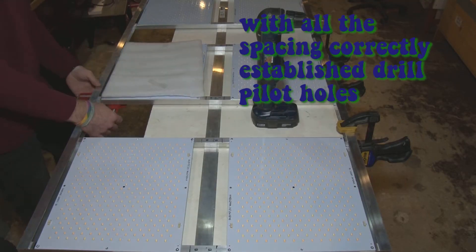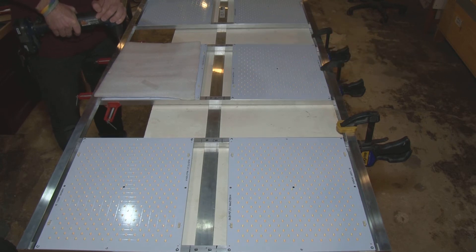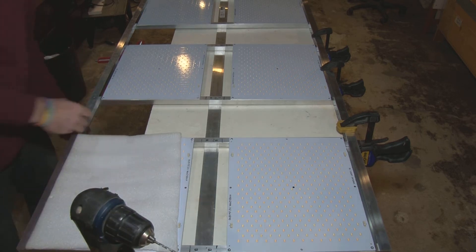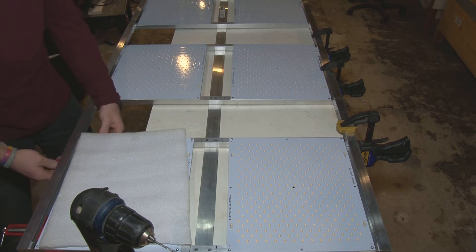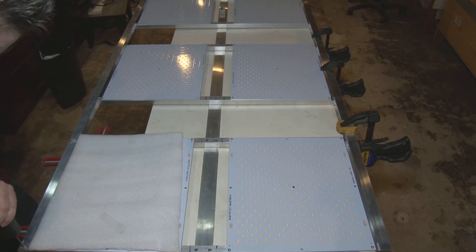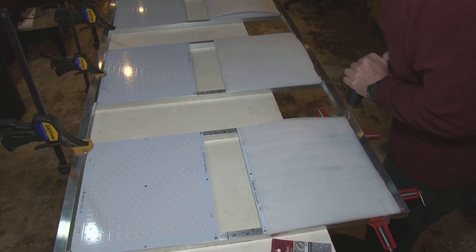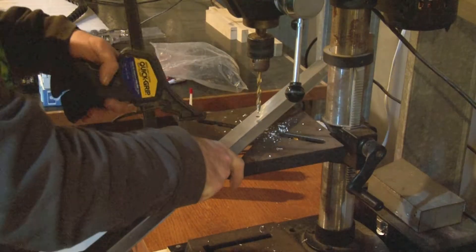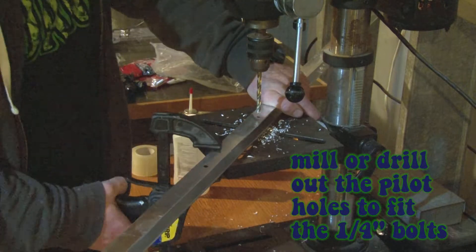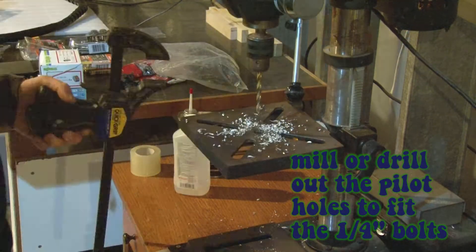Now we drill out pilot holes with all measurements at the right spacing on the C-channels, so I know where to drill for those quarter-inch screws. I also laid down the silver bar I already made holes in — the square aluminum — and drilled into those to have pilot holes for mounting the flat aluminum bar to the middle of it. That gives extra support plus a nice way to mount all my drivers and project boxes for a clean wire line. I take those C-channels to the drill press and using the pilot holes, make sure the quarter-inch screw fits. I do this to all 10 fixtures, keeping every fixture on the same manufacturing step so I stay organized.